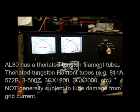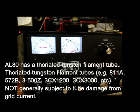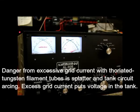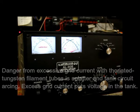This amplifier has a thoriated tungsten filament tube in it, like the 811 and a lot of other directly heated tubes, and these tubes aren't damaged very easily by grid current. People worry about hurting the tube with grid current but that's pretty much not going to happen. What the grid current does in a thoriated tungsten tube is it causes the amplifier to flat-top or saturate and splatter, and it also makes the tank voltage far too high so you can cause an arc in the tank circuit. Those are the real worries with too much grid current in a thoriated tungsten tube.